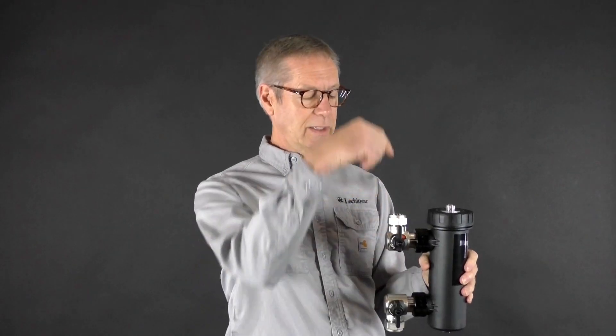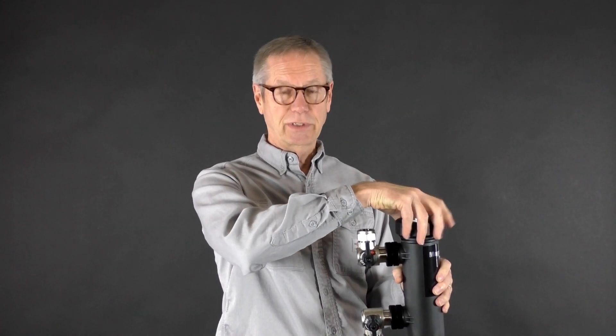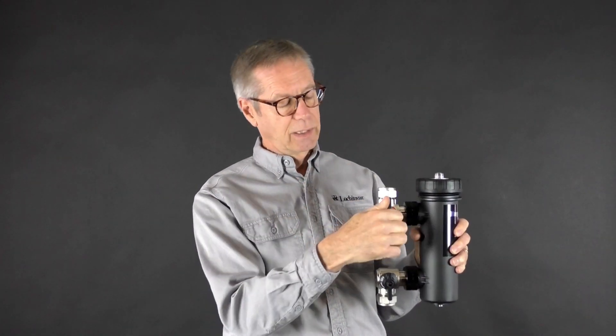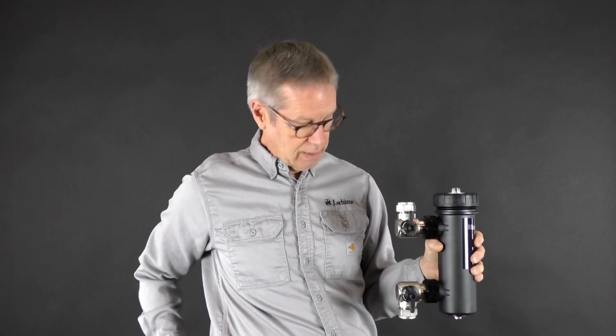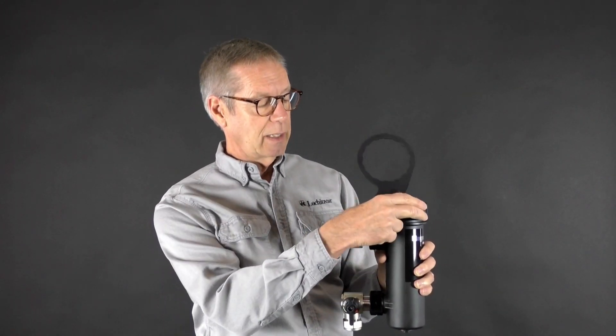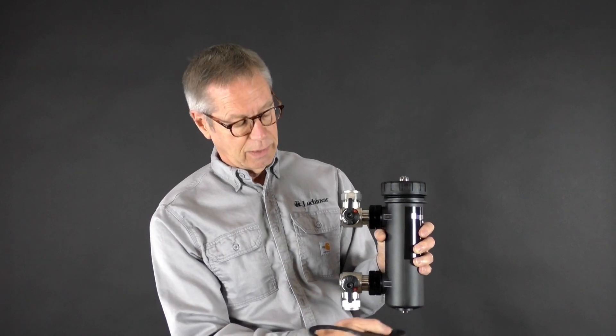A product we're starting to sell now at Cork and Steel that's going to clean up all these problems is the Adey Clean side stream filter. This goes on your return line — the return comes in here and this connects to the boiler. It has the magnetic feature you just saw in the demonstration; all your magnetic material is going to be adhered to this plastic tube right here. You bring it out into a bucket, put it back in — the magnet is inside there — and open the valves back up to the system. There's an automatic air vent you can put on here, or use the manual air vent. It comes with a tool to take the cap on and off, and this is the drain at the bottom. After you isolate the system and remove this, you can drain any solids out through the bottom using this tool.